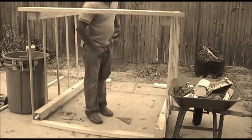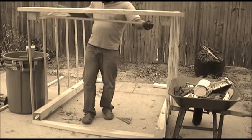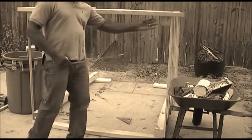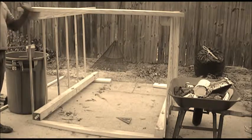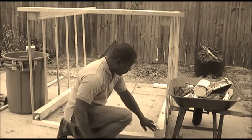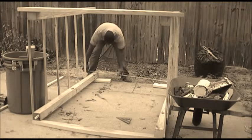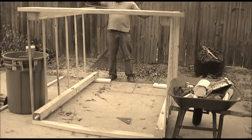Once I check my square, I'll check my measurements from here to here — it's 49 inches. I'm going to pull the wood up. I've got to bump it up one inch here — a one-inch lip — and I'll put a strip on top, making sure it sticks out at least one inch so when I lay my strips down it doesn't hit the 4x4. I'm going to pull it up to a one-inch lip on the back as well. I took my back measurement and I've got 49 inches here too.